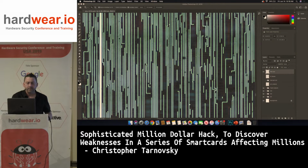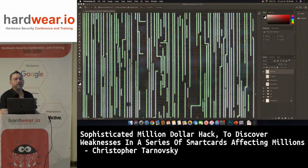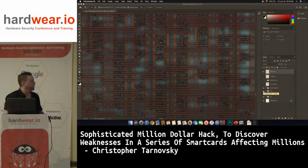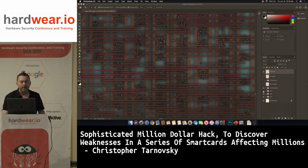So you can see here as we zoom in, the picture's pretty nice. Now, and again, this layer was polished till it was white. So this layer is good for the FIB. We can turn off this. Now you can see here, this layer is not good for the FIB. The only thing I'd see in the FIB are the white dots. That's it. Everything else would be black. I could spray some platinum down, which you've seen on some of the pictures from Chris yesterday. That cross picture he showed you with a ROM, that was where I had sputtered platinum. So I sputtered platinum down because it was pitch black, because there was nothing to conduct. It's all oxide on the surface. Sometimes you can get an image, sometimes you can't. So you sputter some platinum down, you open the valve at a high beam current, and it deposits. But other than that, this needs polished more for a FIB.